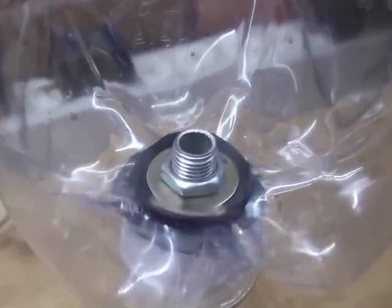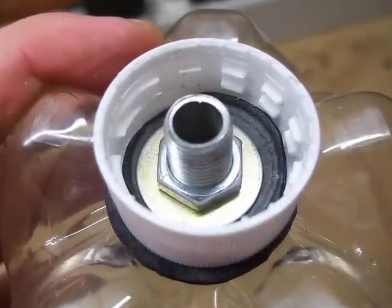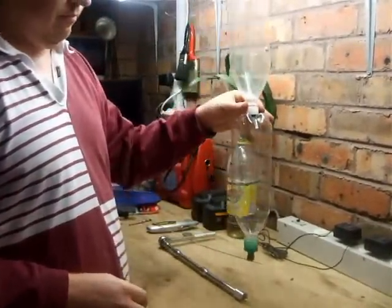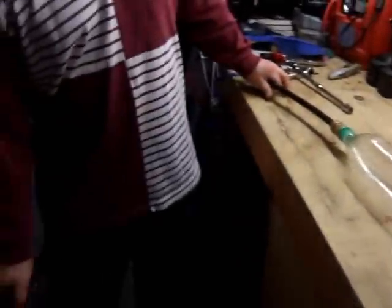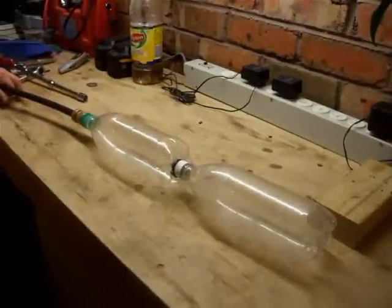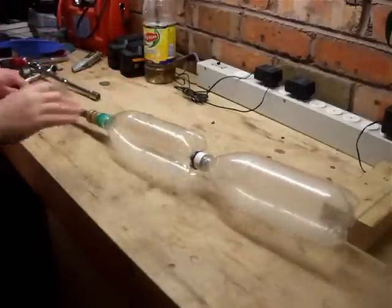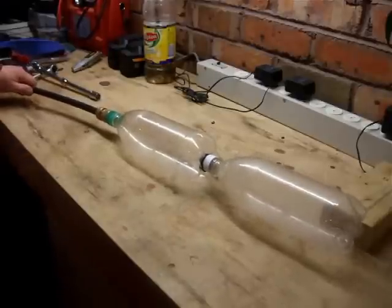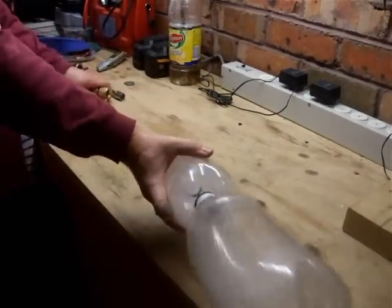There are some close-up pictures of it inside the bottle and inside the cap. Now the last thing we'll do is put the nozzle on — it's our standard 9mm Gardena nozzle — and give it a quick pressure test. We'll test to about 25 psi on the bench just to make sure there are no obvious leaks. Don't pressure test to 60 psi or so on a bench like this — you probably want to do a hydrostatic test, fill it with water and test it that way. But no leaks at 25 psi — no problems at all. Nice and tight. And that's the Robinson coupling.